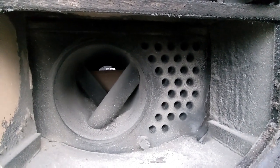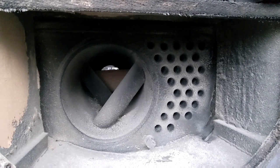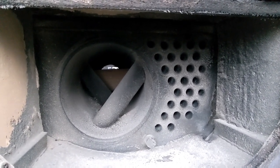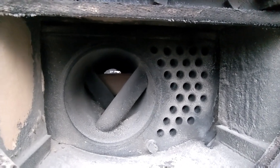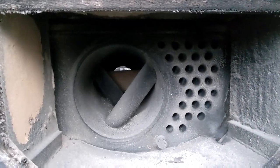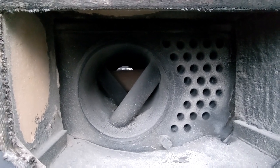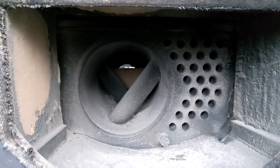Now when the engine's running, the exhaust steam from the cylinder also rushes up the chimney. That's where the chuff chuff sound comes from. And that helps draw the fire because you're blasting steam up the pipe. It's drawing air through this circuit. And to get the fire going, we actually put an electric blower onto a port on the chimney to blow air up the chimney. And again, that encourages that circulation.